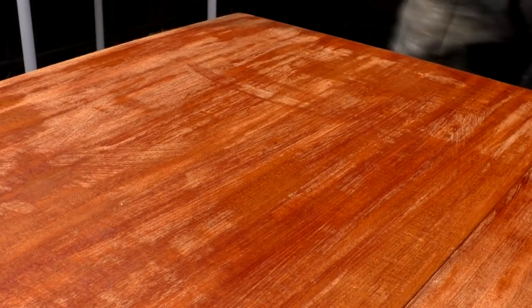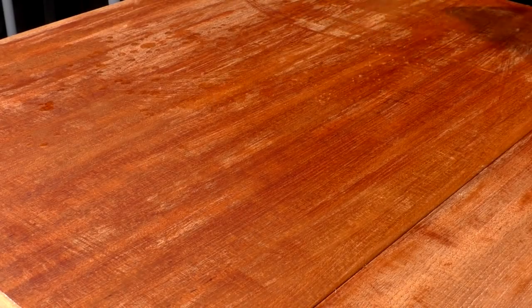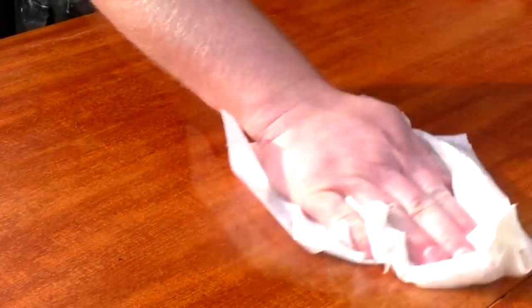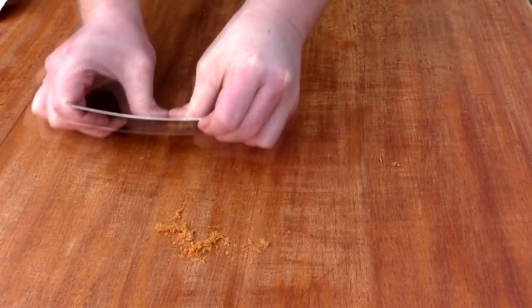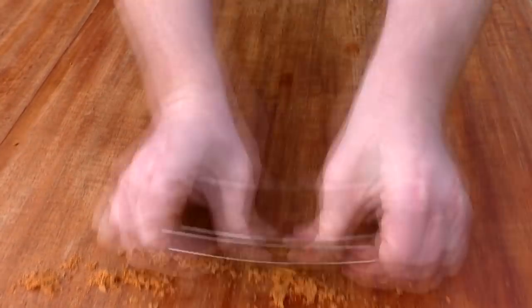After leaving the stripper for another 30 minutes, the remaining old finish came off a bit easier. I then applied some mineral spirits to the tabletop and used this to clean up and remove any remaining finish, applying it with some 4-0 steel wool. Then I wiped it down with a cloth. I used a card scraper to take some light shavings off to take care of the streak marks the stripper had left across the grain. I found it quite ironic that I had decided to use stripper so that I wouldn't have to scrape the whole tabletop, and yet here I was doing lots of scraping.